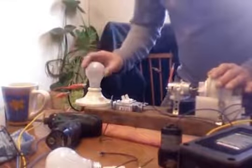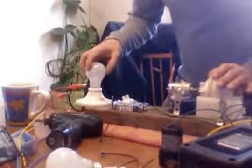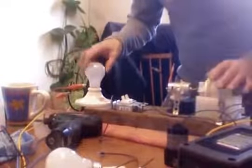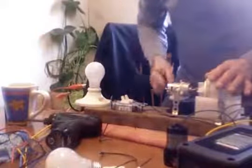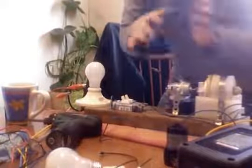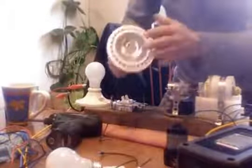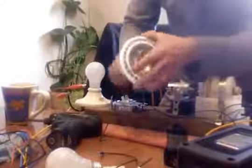Seems like the higher the voltage is, if I run this at about 205 volts, a 12 volt fully charged battery, this bulb, when you do a test with your meter, it seems like it draws about 20 or 30 volts. It'll drop from say 205 down to 187 volts, and she's bright as hell. Also picked up an LED bulb, is all this is. It's a $30 bulb. They're very expensive. You thread that in there and it only uses, this is 100 watt, this is 20 watt, lights it up just like a freaking flood lamp.